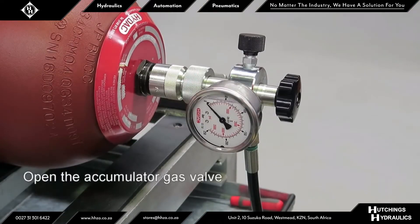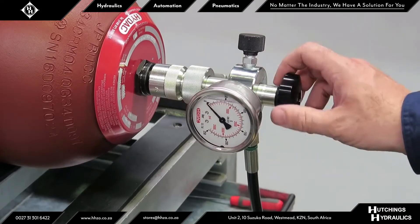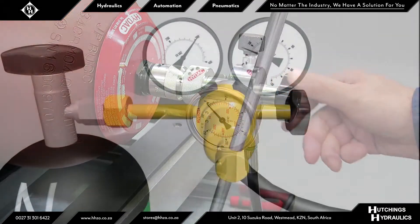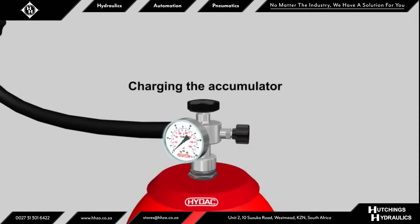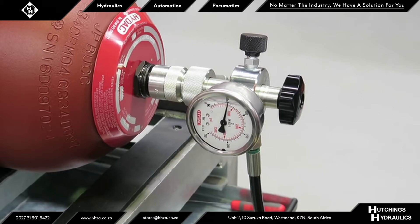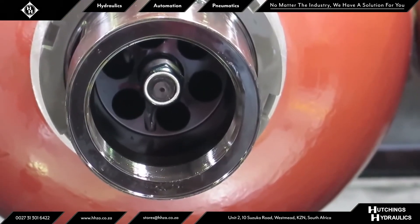Slowly turn the main spindle of the charge head clockwise until you feel resistance to movement; at this point back the spindle off a quarter of a turn. Begin the gas flow from the bottle to the accumulator by slowly raising the pressure at the regulator. When shipped, the majority of high-capacity bladder accumulators are charged to two bar. At this pressure the bladder is inflated and in contact with the inside of the shell, ensuring little chance of damage. If the bladder is new or has been deflated, the initial inflation must be done as slowly as possible to avoid stretching or rupturing the bladder. You can assess if the bladder has been inflated by checking the position of the fluid port poppet stem — if it has extended, the inflated bladder is pushing the poppet valve closed.